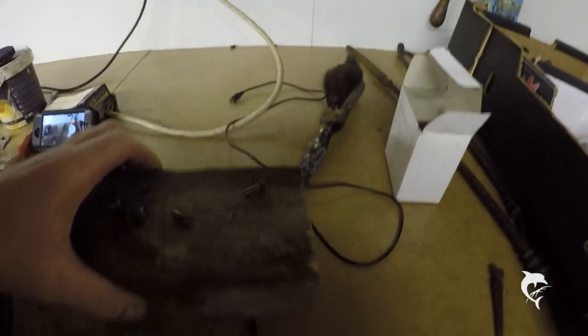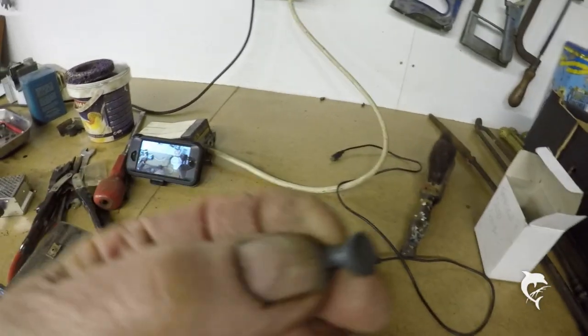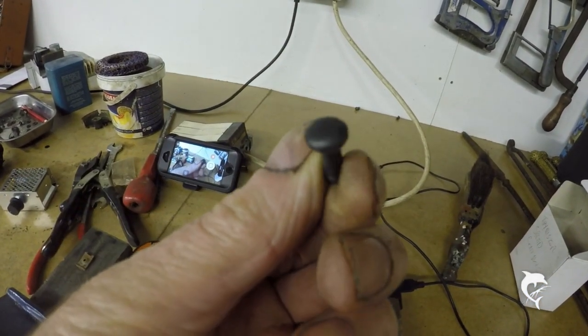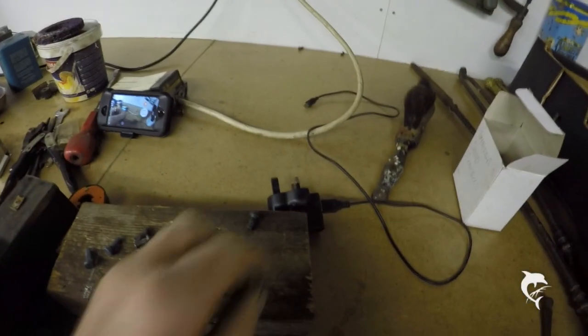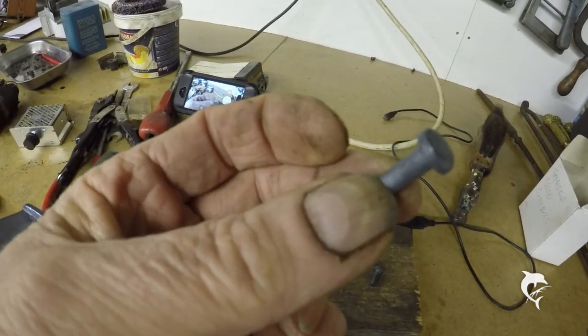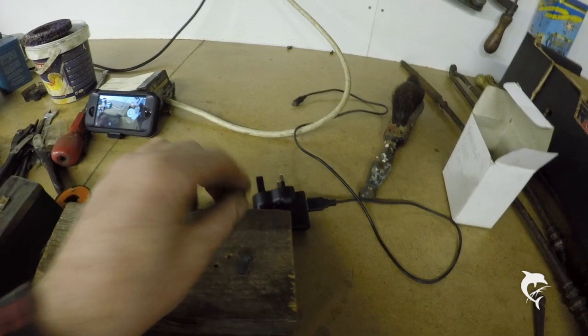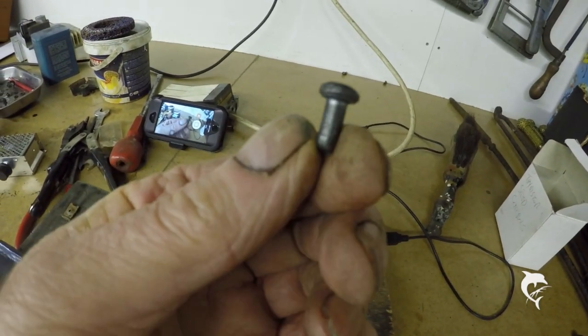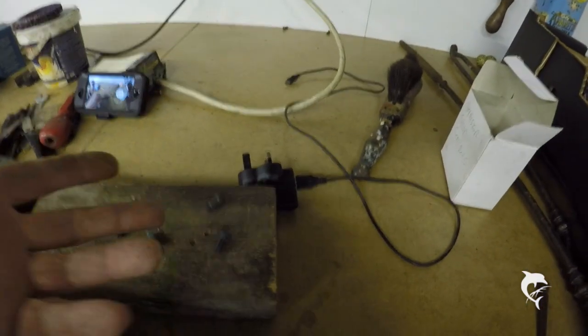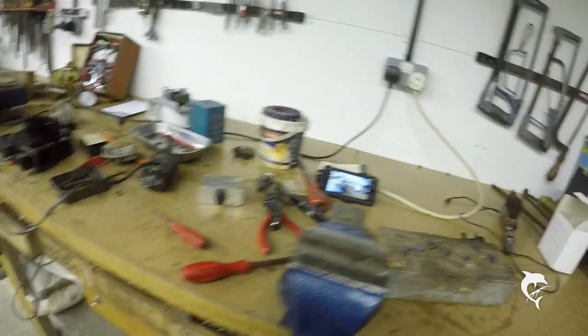Other than that, I've finished my rivets. These are the finished rivets for the shovels — to put the shovels back on. I think they've come out really well; they look the part, they're the right size, the right shape. So that's probably how I'll make rivets from now on — on the lathe, then heat and anneal them, which also colours them as we go.